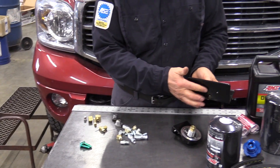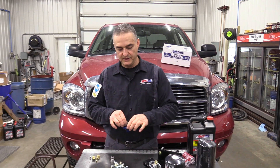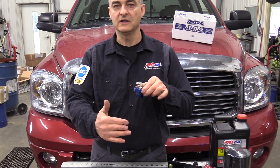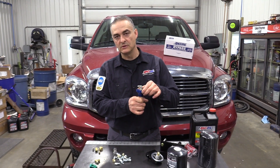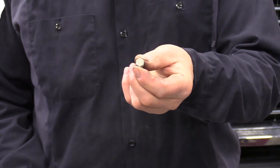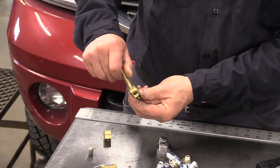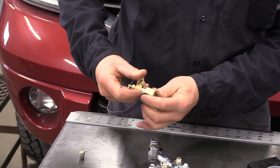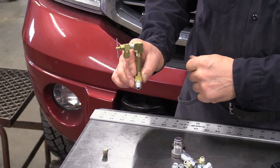I've also got an oil sample valve. There are two ways we can take oil samples on this engine. We can use this here with the engine running, but the only issue is the fan is fairly close to the front of that valve cover — if the engine's really hot and the A/C is on, that fan can kick in and blow against it. You can still take your sample right here with the bottle while it's running. The other way: on the full flow filter there's a small 1/8-inch pipe plug — that's where we'll be sourcing the oil for the bypass. We can put a T into that fitting and install a sample valve right on there, sticking up enough to get in and take your sample. That port also supplies pressurized oil to the filter system.